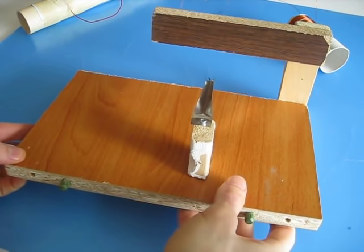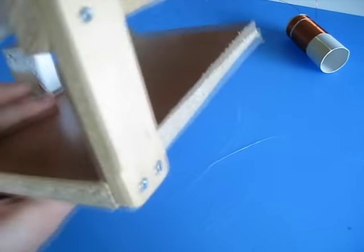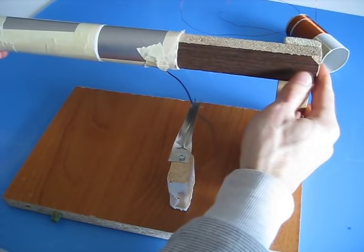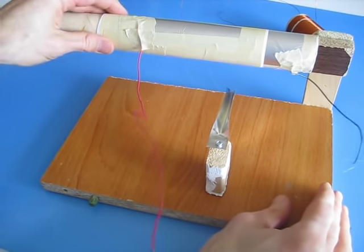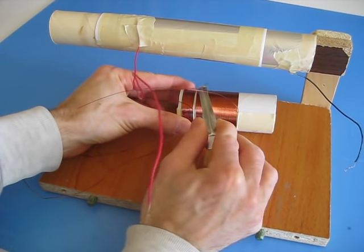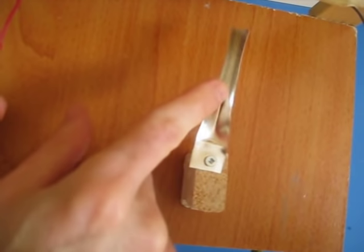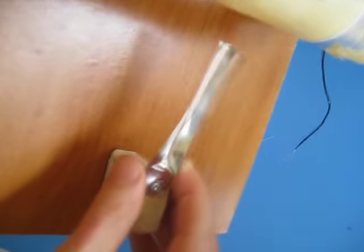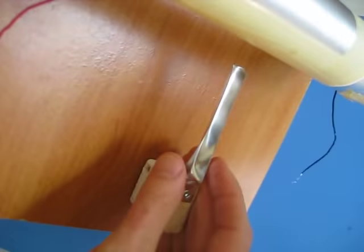The next step is to make a good holder for all of this. I got literally pieces of scrap wood — I screwed a piece of scrap wood here, and on the back I also screwed some more pieces of scrap wood together. The whole idea is you take the capacitor and just slide it on like that, so for adjusting the capacitance you can just do that. Now for the coil you're going to need some way of tuning — because this is a tunable crystal radio. For that I've got this piece cut from a paint can, bent into a V-shape to make a wiper blade. I put a little screw here and screwed that to the top. Where it wipes against the coil, it's a fairly smooth surface but comes to a point.